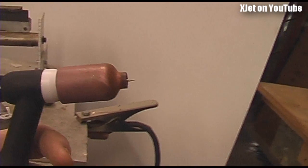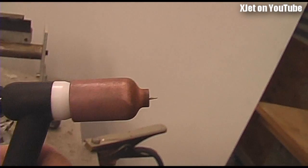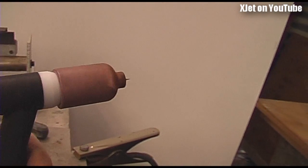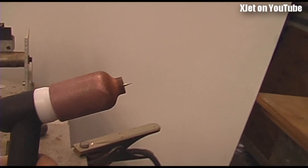It's really quite simple - the electricity provides the heat to melt the metal. You have to make things scrupulously clean when you're TIG welding, otherwise the metal doesn't flow together - it just sits there and forms two separate lumps with a big hole in the middle.